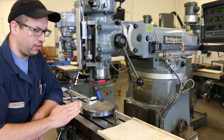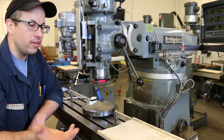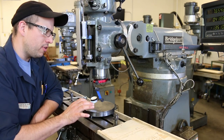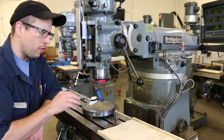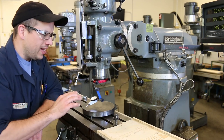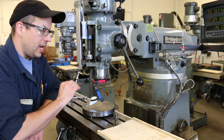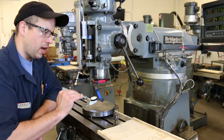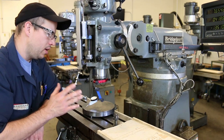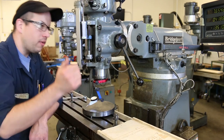But anything under, let's say, 12 to 15 degrees, the error is not typically very big, mathematically speaking. Also, we're not really looking for a specific absolute number for our measurement here. We're just trying to get everything to read zero everywhere, right? So if half of a thousandth of an inch or one thousandth of an inch on this dial exactly correlates to a half a thousandth or a thousandth of movement, doesn't really matter. As long as it reads zero everywhere, we can get it close enough. All right, but we should maintain that 12 to 15 degree relationship. So that looks about right there.